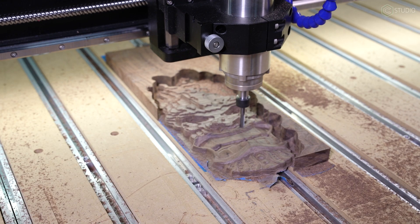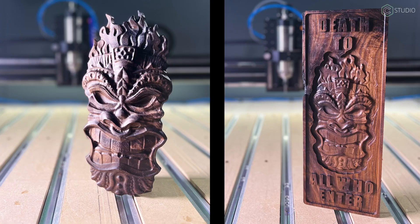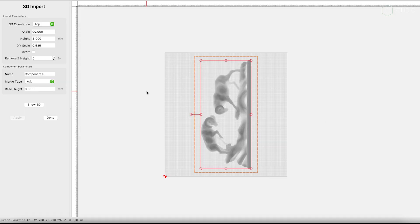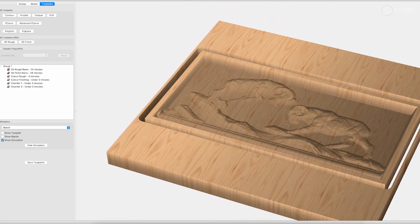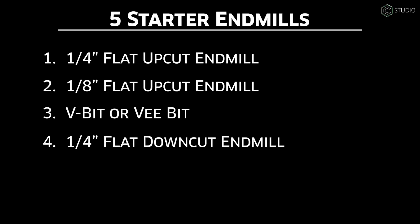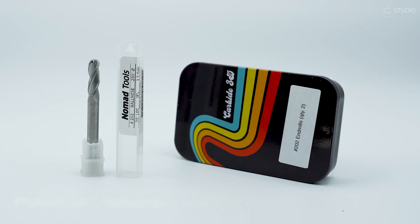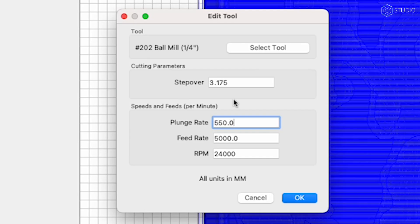Finally, I want to see you with some 3D capability. Creating 3D shapes has never been easier, and planning the appropriate tool pathing is also automated and accessible. Importing STL files or creating 3D shapes from contours and imported images opens a world of creativity. In order to incorporate these show-stopping features into your next project, you'll need a ball endmill. Start with a quarter inch three-flute ball — Carbide 3D offers the 202. Again an upcut, you'll need to reduce the stock stepover to 10 to 15% of its initial setting. This will produce a detailed 3D shape in woods, metals, and some composites.